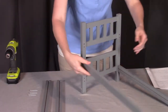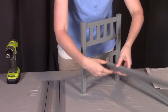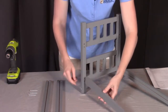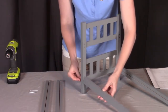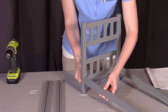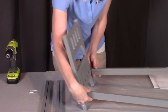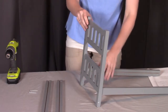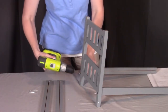I'm going to put on the other side right away. So the dowel on top, screw hole on the bottom, and the groove to the inside so that these grooves line up going across. To put these in place, we're going to screw from the back side. For this assembly, I'm going to be using a drill. If you choose to also use a drill, make sure that you have the torque settings on low so that you don't strip any of the pieces.